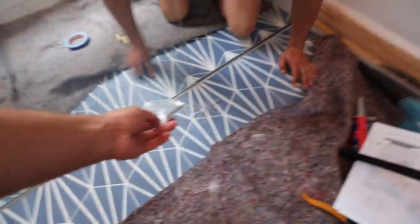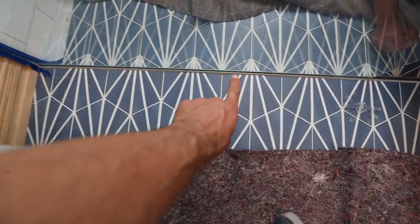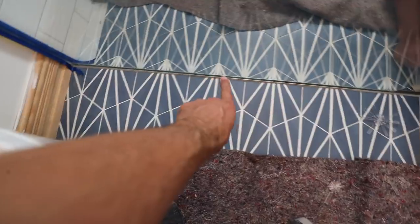Here's your Allen keys, mate. So we're just making sure that the glass is sitting parallel with the track below. Put the right amount in. And then once that's set, then we'll be able to put silicone between the glass and the track on the outside, create like a seal. But for now, we're just putting little packers in to make sure it's even.